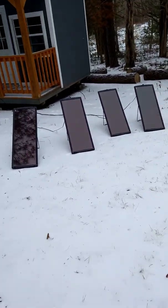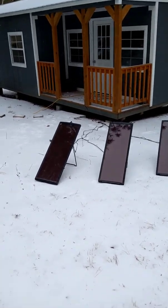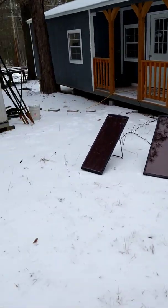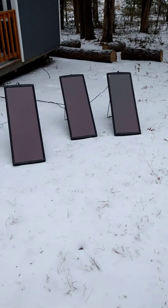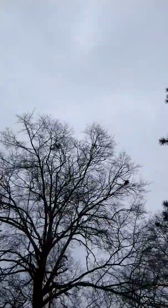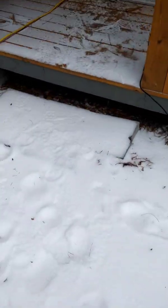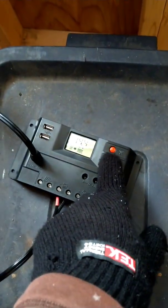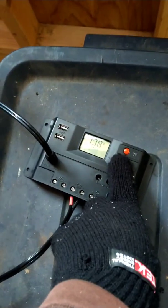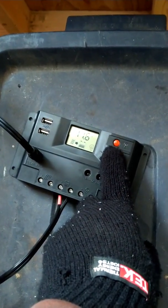Kind of cloudy yesterday because it started sleeting, and today we actually got snow. I had the solar panels on the front porch area earlier for about three hours trying to see what kind of charge I would get. Getting ready to go check it. I brought them out in the snow so I can get the last little bit of sun connection — it's still kind of cloudy today, no direct sun, but these things still get some juice from just light in general. After about three to four hours, it went up to 11.6 volts. I was at 11 volts earlier.